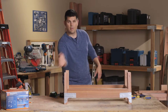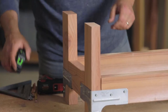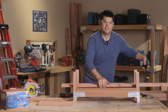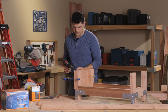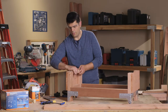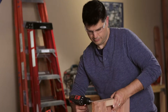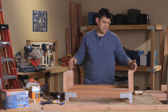The next thing we need to do is put the wrapping — the shell — of the planter box on. We're going to cut the end pieces, which are exactly 16 inches in length. The next step is to attach those to the sides of the planter, making sure everything is nice and even. For this we're going to be using the Deck Drive DSV wood screws. I've cut the two-by-two for the top — it's a nice fit — and we'll make sure it's flush with the top.